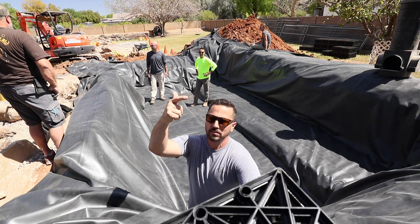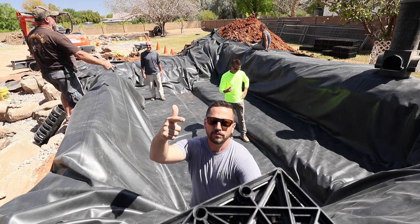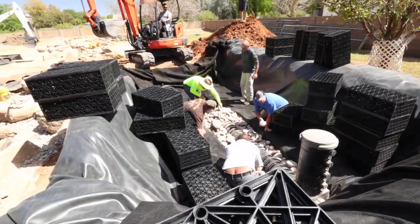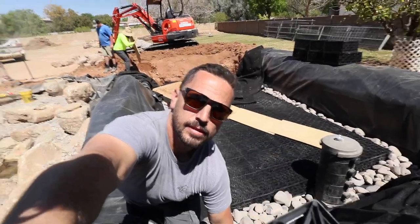Our fabric and liner are in the excavation. Next comes our centipede modules, along with our snorkel, and then the layer of aqua blocks. Before we get started filling the whole wetland in with our graduations of rock and gravel, I want to explain what we've done already. There's a sedimentation chamber on the bottom that's going to take out the big particles. Then we have different layers of gravel — that gravel layer is home to different types of microorganisms. We're going to add bacteria, enzymes, and things like that. Once established, those microorganisms feed off all those organic compounds that could cause water problems, so the wetland filter eliminates all of that.